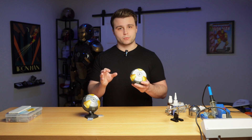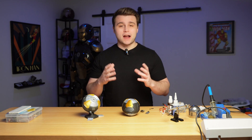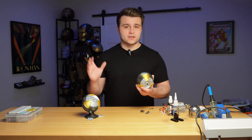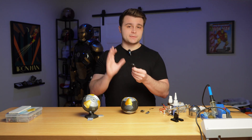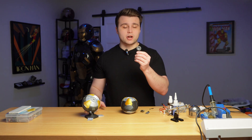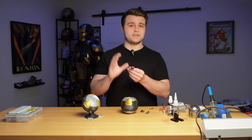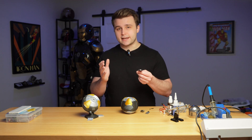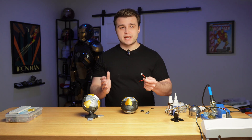You're not going to need any blue or red LEDs. For the lights we're going to be using a NeoPixel ring — specifically a NeoPixel ring with 12 RGB lights. Links are in the description. You'll also need a speaker to play the sound effects; the one I used already came with the JST-XH connector. The button and NeoPixel ring do need wires with JST-XH connectors to connect to the PCB.